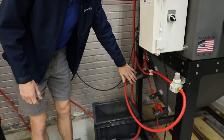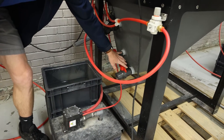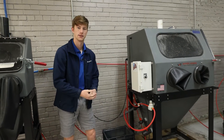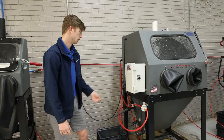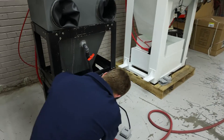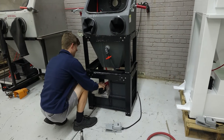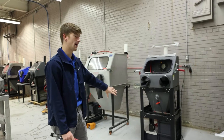With an 800 style cabinet you also want to make sure the bottom ball valves are closed. To clarify what those are: the bottom ball valve is used to drain the entire machine — all the abrasive and water will come out there. If you want to leave the abrasive in the machine, there's another ball valve that drains just the water and leaves the abrasive in. For the bottom basin, fill it to about one to two inches from the top so you have a lot of water in your reservoir. I'm going to close that off — that's the correct amount of water to allow rinsing and window rinse without running out.